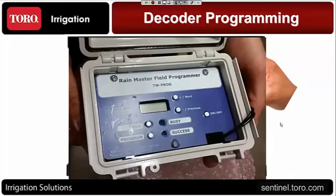Disconnect that decoder, make a note on it that it's now 005, set it off to the side and do the next. It literally would take about maybe a minute at most to hook it up, program it, read it, program it, mark it, put it to the side. So it's a very simple, easy process to get these decoders set up in the field.